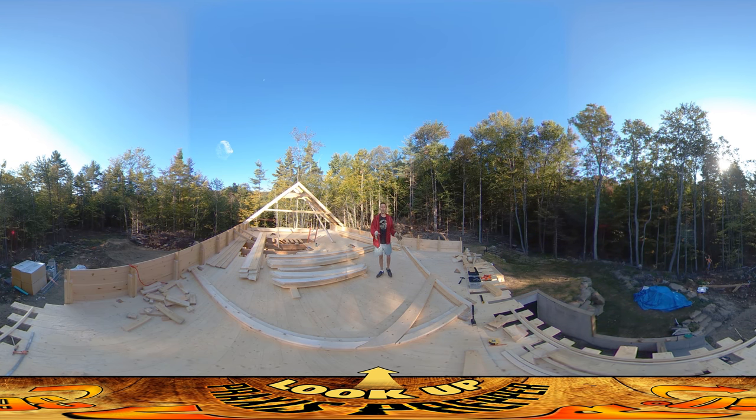I can at least nail all this together. After these pieces go together, I'm going to take another set — the southwest and northwest 2x8s — put those on top to sandwich it all together, and see if I can move it and get it up and over somewhere. I guess I can maybe make a second or third one, but I don't want to struggle too much. I don't want to force a two-person job with just one person because it's going to take extra time. If I have one-person jobs available, I'll get a lot more efficiency doing those than trying to do a two-person job alone.